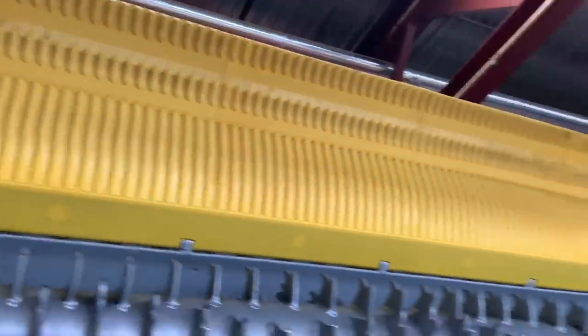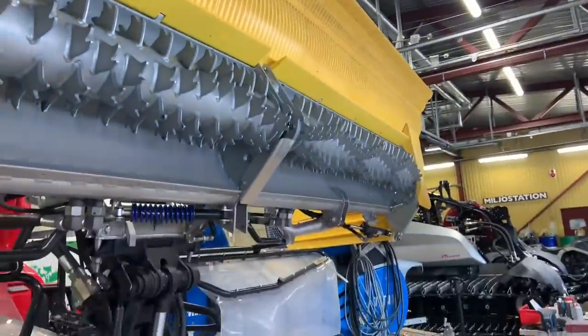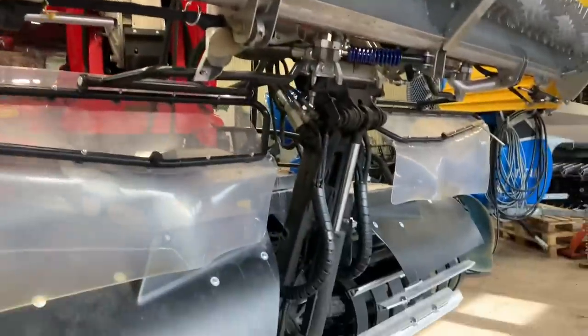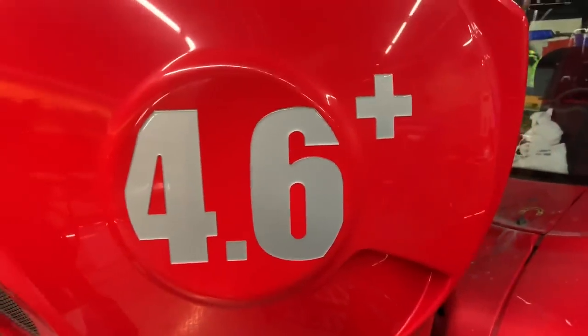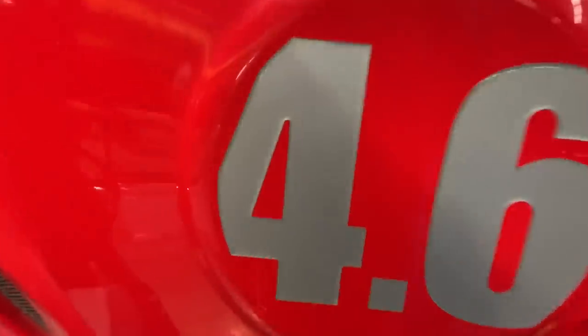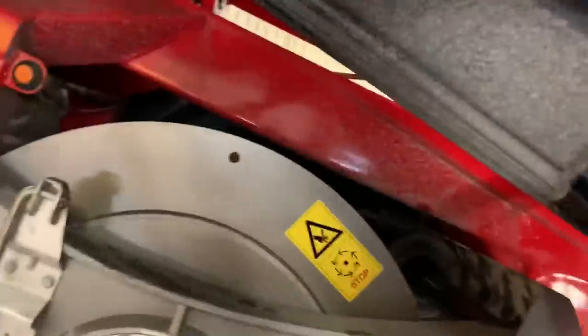Those tiller mats leave the corduroy finish behind the machine, which is what everybody skis on. This is the 4.6-plus-ton winch — I think it pulls up to about 5 tons, which makes a very big difference on your steep slopes. As you can see, the winch cable gets pretty dirty. This is a capstan winch system.